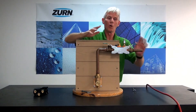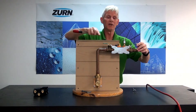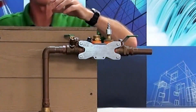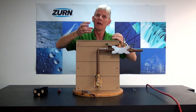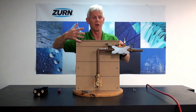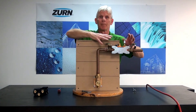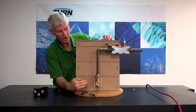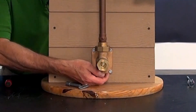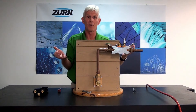There's one last thing I want to do. We can leave the blowout flush fitting in there all winter long — it's not a cross connection and it's not going to cause any problems. I do want to leave my remaining test cocks and shut-off valves in the half-open, half-closed position. By doing that, I prevent the ball inside the bronze body from trapping any water. If they're either fully open or fully closed, that water could be trapped and damage or break the bronze ball valve or test cock, forcing replacement. So after the blowout procedure is done, leave your shut-off valves in the half-open, half-closed position. I'll also drain any water remaining in the incoming riser by taking the plug out of the bottom of the ZW3 winterizer, and that's going to allow whatever fluids remain in the winterizer and my incoming riser to simply drain out to the ground. And now I've winterized my whole irrigation system.